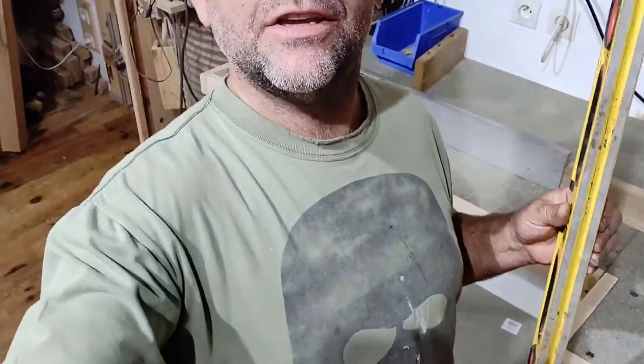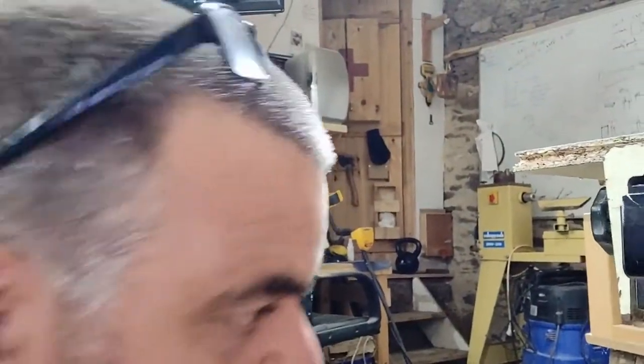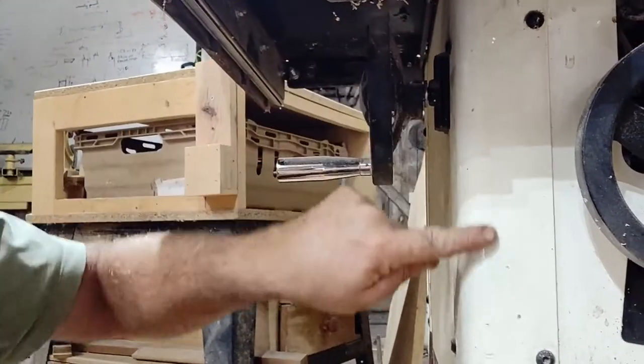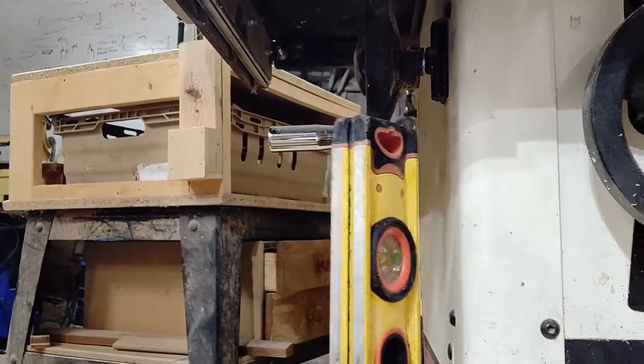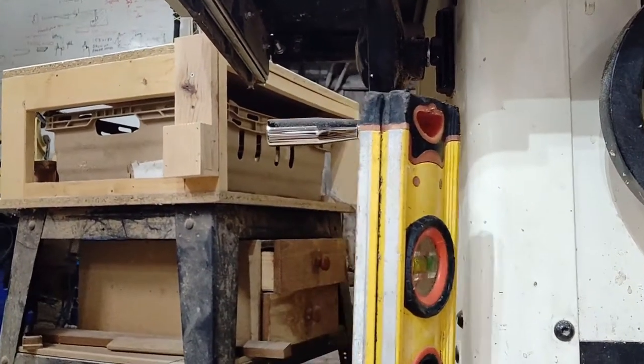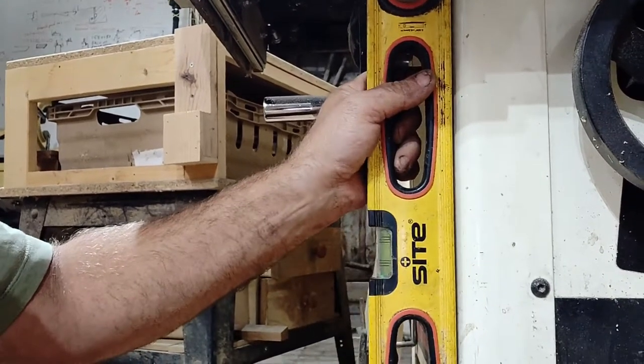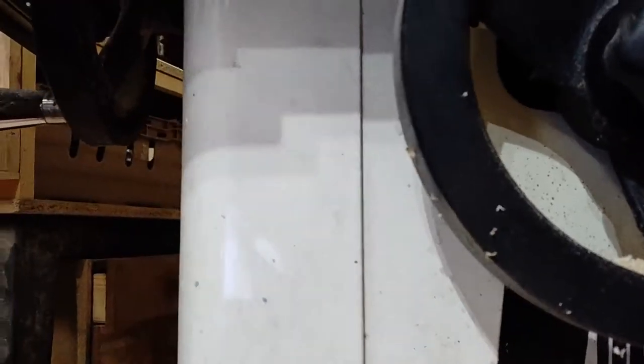We need to find a surface that you feel comfortable using. Here we go — this is perfect. I'm going to use my table saw, because I know that is most definitely true from top to bottom and it hasn't got a bend in it. We must also make sure there's no debris, because this is a magnetic level and you could have screws or nails stuck to it. I'm going to place that on here like so and get a visual of the bubble. In this case it is fractionally to the left — I'm just going to mark the bubble. Drywall markers are quite good for this job. Then we turn it for the plumb again and check for level again.